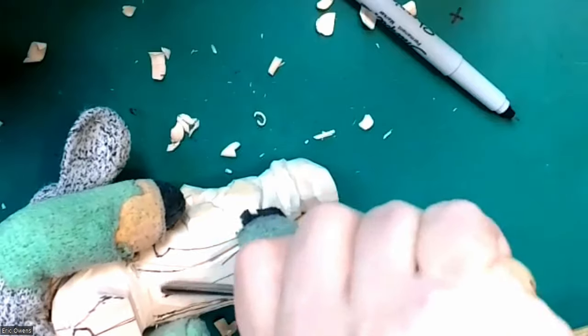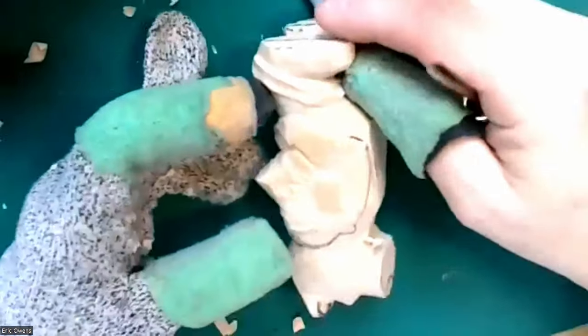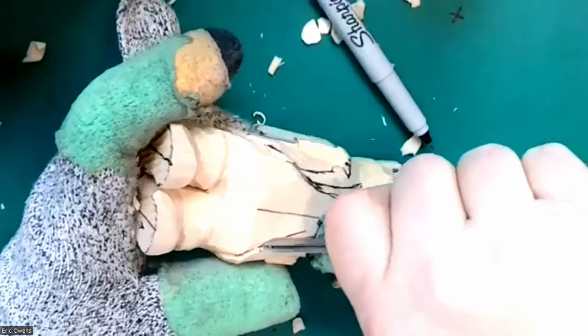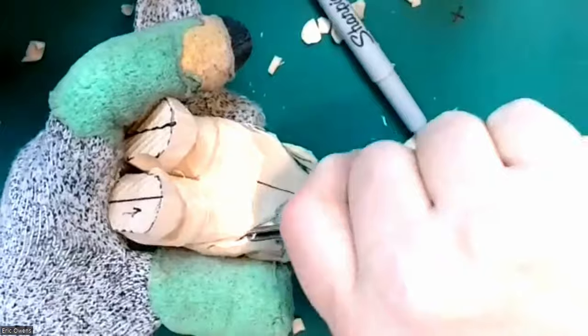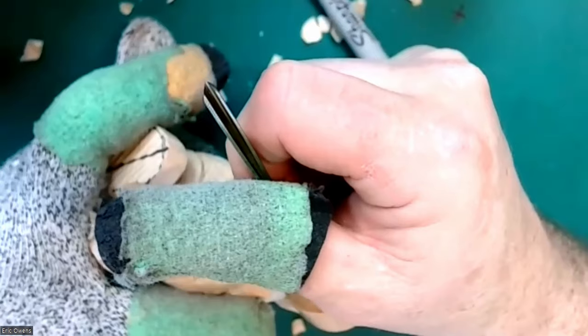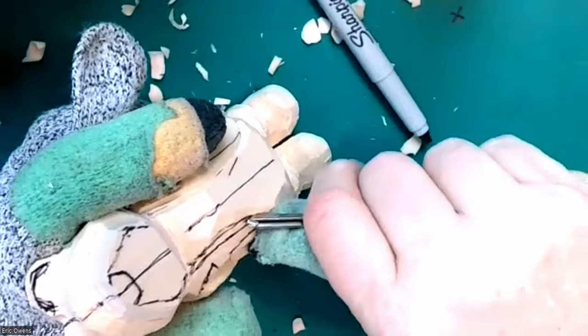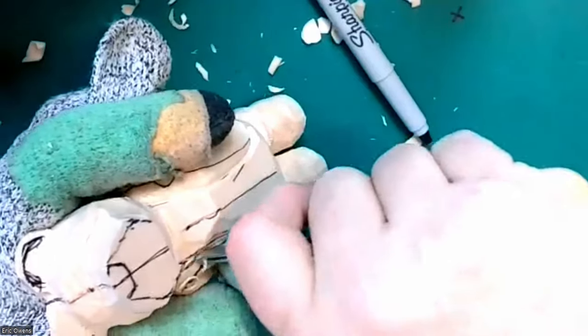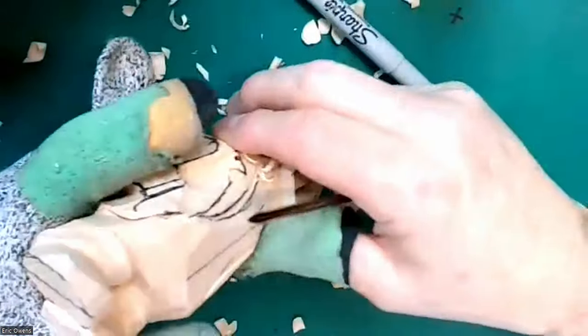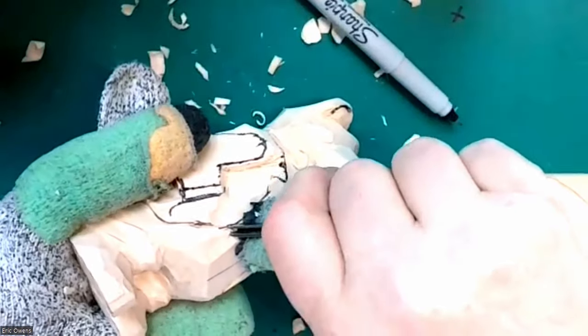Just know that when you buy them, every tool you have to sharpen. You have to hone it. At the very least, you have to hone it. These are ones where they're thicker metal. It's harder sometimes to get that bevel perfectly right, and the worst ones to get it on any tool is a V-tool, right? Am I right? Those are the ones that are really hard to keep that very middle piece even, because it'll dip down below the edge of it. It'll still cut, but it looks ugly when you get it down below. And sometimes, depending on how far down below you get it, it won't cut. So just be careful, these are not finicky, they're a little more precision. So they're precision metal, and it's good stuff.